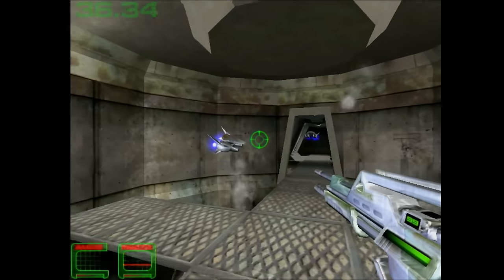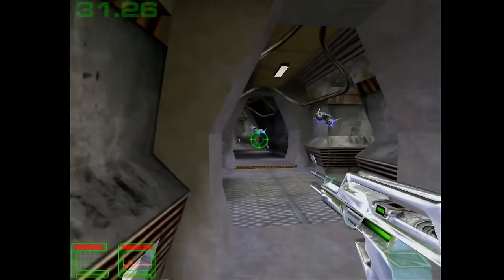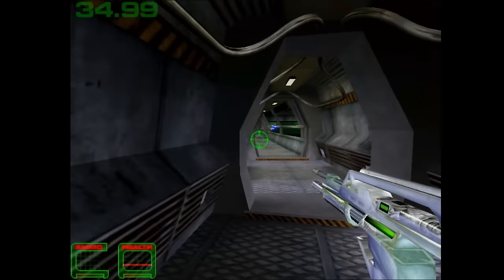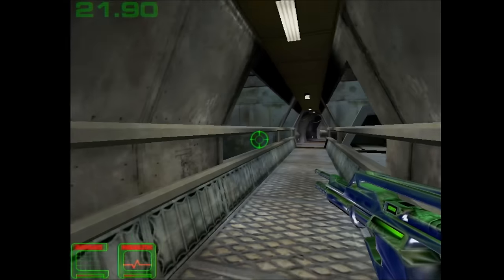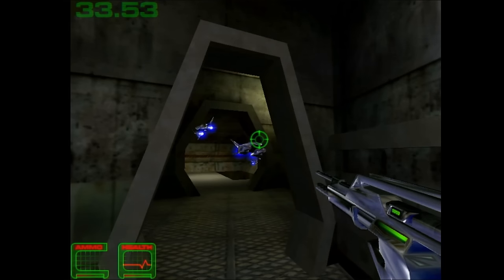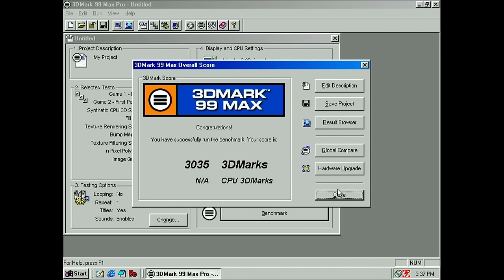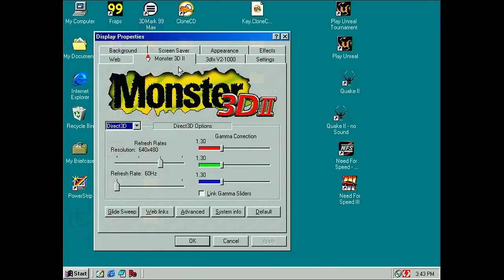And thank you so much, Maksim, for sharing your tool with me. This definitely helped out a lot. Unfortunately, the FBI chip was damaged. Of course, this is something very difficult to analyze. It could be the memory, it could be the chip. Yeah, but after replacing the memory chips, or removing the memory chips, and then getting the same error message, it was more or less clear that there is an issue with the FBI chip. And I went the extra mile and got the 3DFX chip replaced, and now I'm being rewarded, as it looks like.